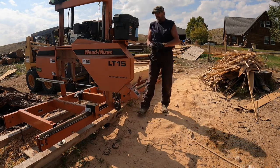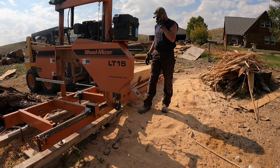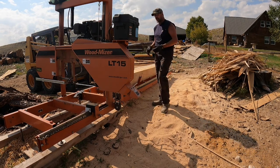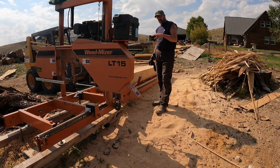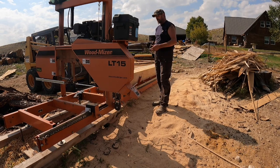So there was something I wanted to share. Seen a lot of guys cutting and leaving boards on the stack as you cut down. And with AccuSet, that works perfect because the computer takes care of everything. But if I make 4 or 5 cuts, then I got to raise my blade up like 6 inches to get over the top of those coming back to make another cut, and then you got to go back down to where you're trying to set it. Just a lot for me to keep track of in my head.